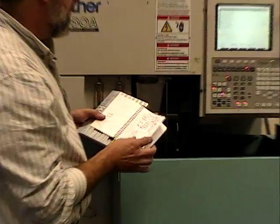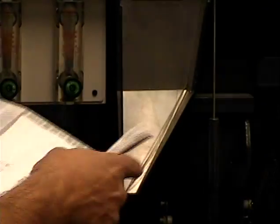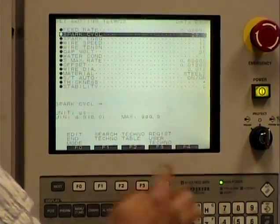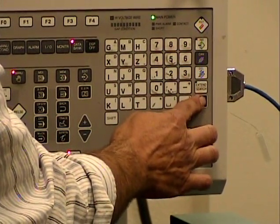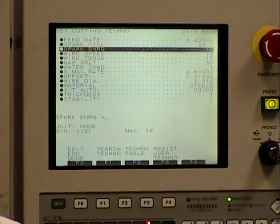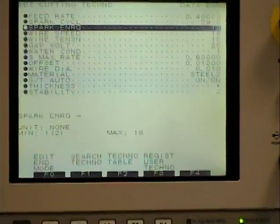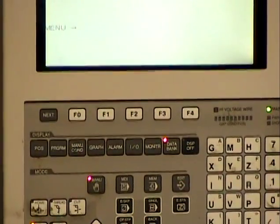For us right now, we've got a piece of eighth inch aluminum, so we'll do that one. Feed rate: 0.4 — we already have that. Use the cursor key. Spark cycle: they say 29 — enter. Spark energy is 12, we have that. Wire speed 18, we have that. Wire tension 15, 35, and maximum speed 0.6. Those are all agreeing now. We've got to make sure they agree. When you're all done, hit the F0 key twice — once, twice — and it's done.